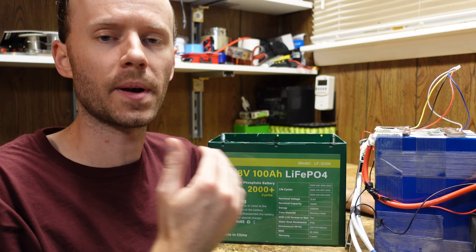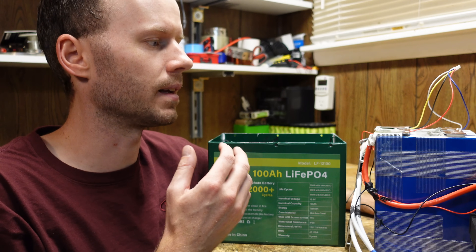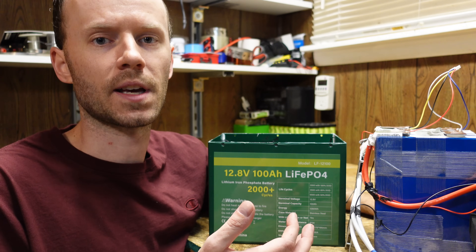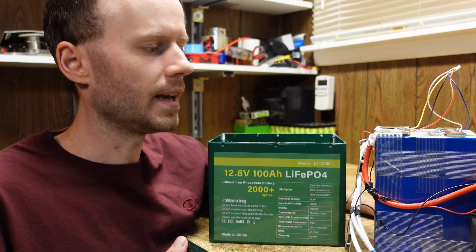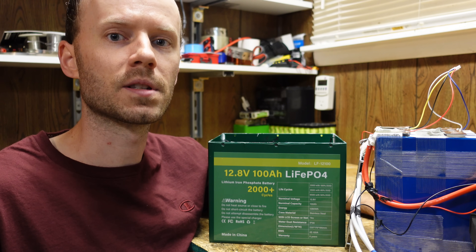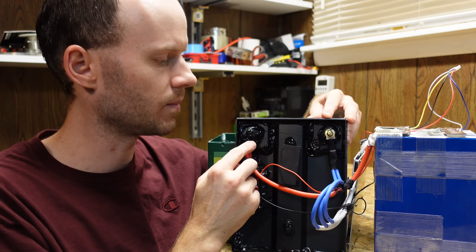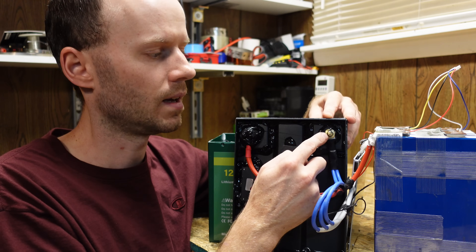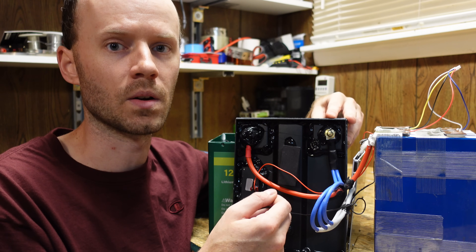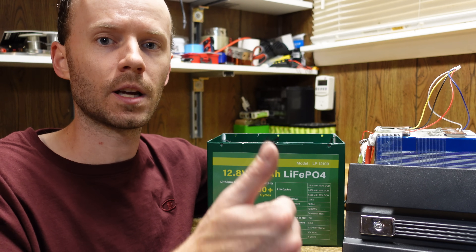I've put in way more effort than I should have trying to get full capacity out of this battery. Not only is it not a 100 amp-hour battery as advertised, it's also not achieving the 105 amp hours indicated by the cells themselves. Overall I still don't think this is a bad battery, but I would not personally recommend it because it's not meeting specifications and it's being falsely advertised. In addition, it does not have low temp charging protection on the BMS, which needs to be clearly indicated where it's sold. Also, the negative terminal lacks the sealant present on the positive, meaning water could seep in despite the IP56 rating — which indicates it should handle a heavy stream of water. I hope this video helped clarify and answer the questions that were asked.